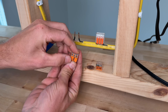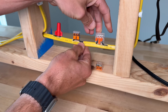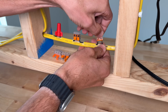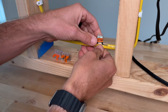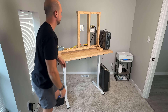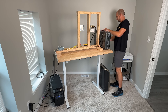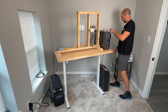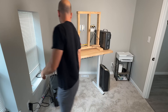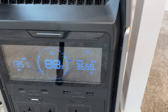I'll swap off the last connectors — that was the larger 613 WAGO lever nut, which can go up to 10 gauge, and this one is a 413 that can go to 12 gauge. Then removing the Harbor Freight lever nut, which is new to the market and did pretty good in the last testing. Then I'll install the WAGO push-in connector, the 2773, making sure the wires are fully seated, which are easy to see through the transparent housing. We'll be loading these up, providing power from an EcoFlow Delta III, which can easily provide 30 amps and up to 4,000 watts out — cranking up three space heaters off one outlet to get all the way up to 3,600 watts, pushing right at 30 amps at 120 volts. Obviously I do not recommend doing this at home; this is just for a controlled test.